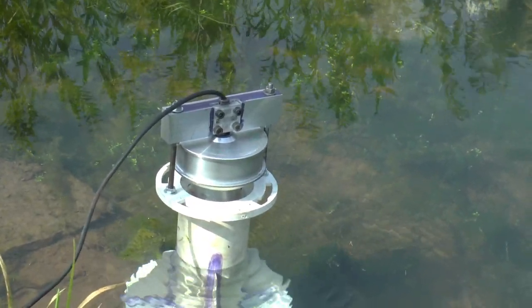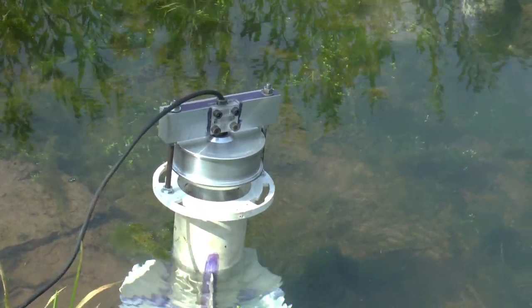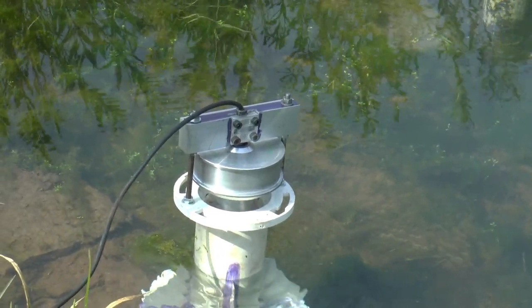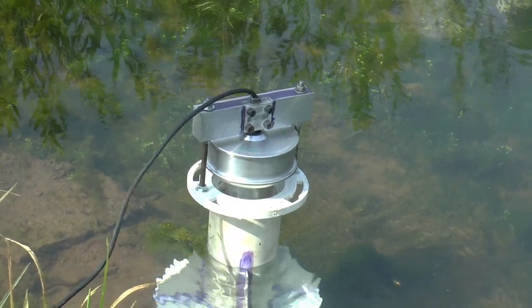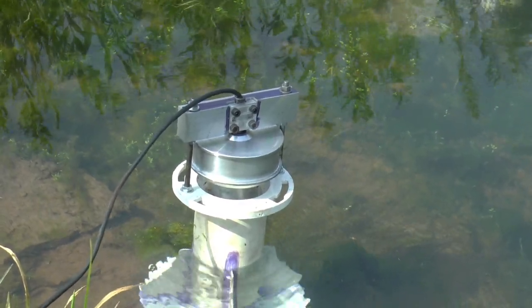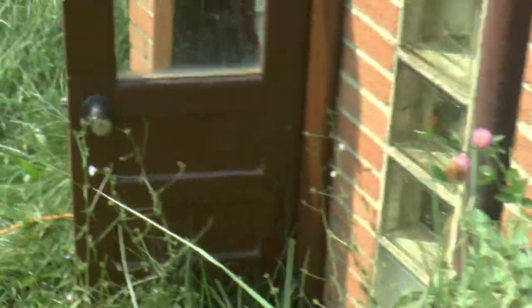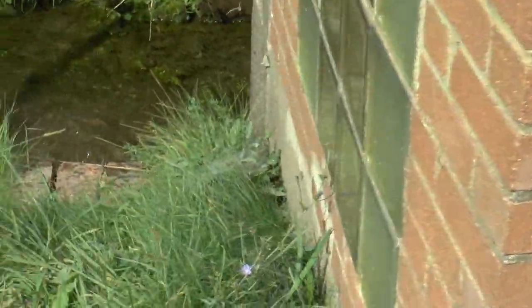What I did was I took all the windings off. It had 12 turns on each coil and I think there's 27 coils. I was able to get 20 turns on with just the next size smaller wire — I think it was 20 gauge wire. They had multiple wires paralleled around the coils.